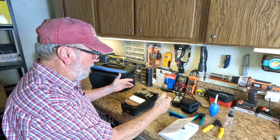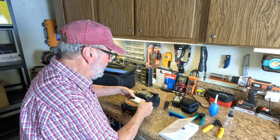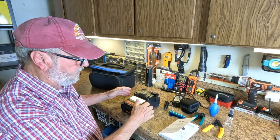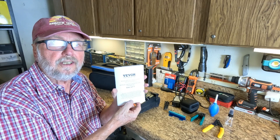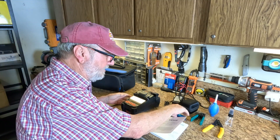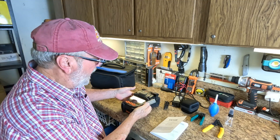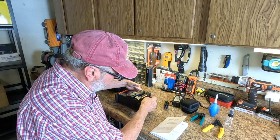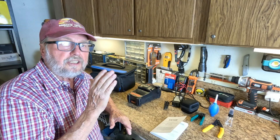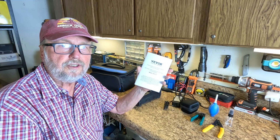Once it has been fused, you've got a heating area right up here that you're going to take that fiber connection, lay it in there, drop this over, and hit the heating section. You know how to heat it up and get the insulation over it. And then somewhere along the line, this little cooling tray helps solve the problem, and it mounts right on the back right here. So it looks like it's covered all of the features you need for fiber optic fusion splicing.